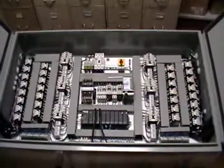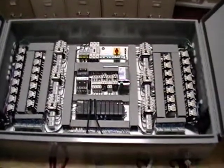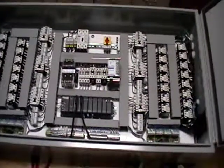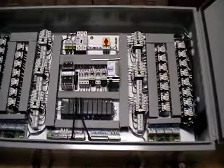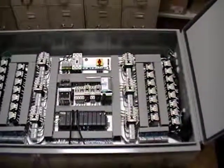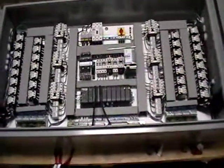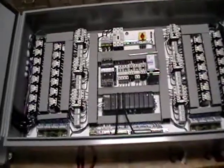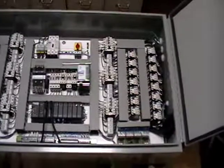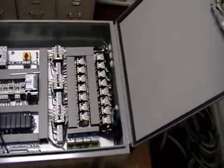Welcome to Black Alloy. What you're viewing is a 30-unit motor control and a PLC control. Black Alloy manufactures self-feeding drilling equipment, and as an added accessory we also build the drives and controls to control the stroking, the motor functions, and the amount of motors being controlled. This happens to be a 30-unit control, broken down into groups — there are five motors per group and six groups being controlled.